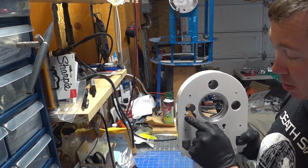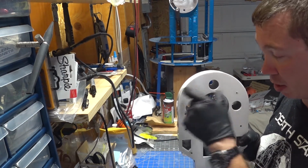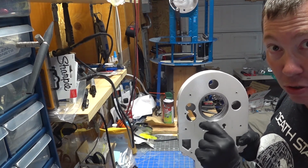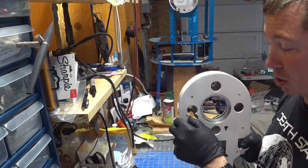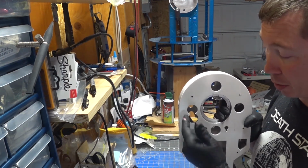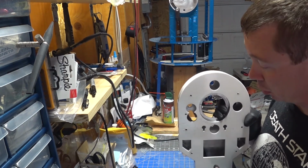We're going to clean up the leg, and as you can see, remember this is the front side because there's my horseshoe buttons forward lock nut hole, so I can basically lock the horseshoe into place. So I'm within about 1/8 of an inch of that hole. I really don't want to get too much closer. The left leg got a smidge closer to it. I'm not too worried. This is thick aluminum, and it's only really there just to provide stability, so it's not a whole bunch of strength that has to be in that position, just enough to be able to grab on. And worst case, if I had to, I could reverse. I could make the hole lower, and it would be right about here for the other button. So not a huge concern.